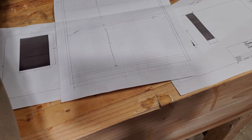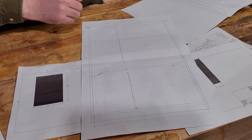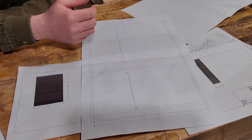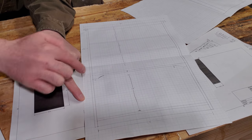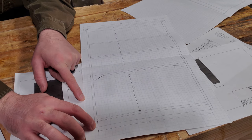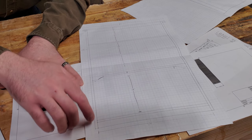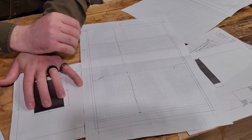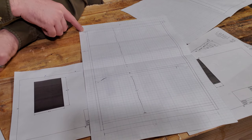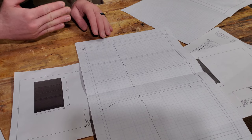So this is kind of what that's going to look like. This is my final drawing. I basically started with the same little rectangles — and if you notice, I have little ticks on the edge. I centered it, figured out the distances, took little ticks, and marked where all my lines were, then connected them on both sides and drew lines across. For the top, I'm going to do a quarter-inch chamfer — quarter inch on the top and the bottom.